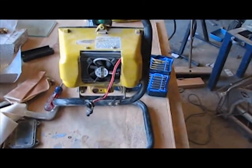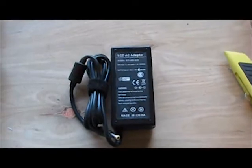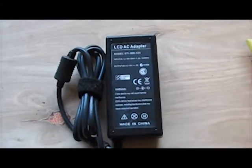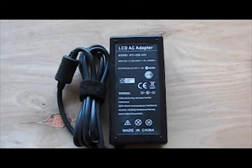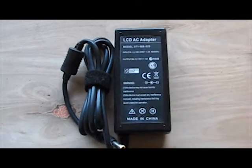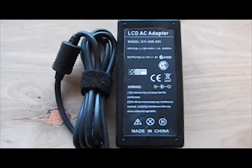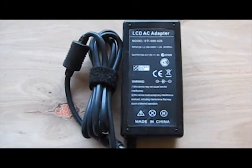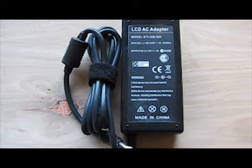Okay, I got that mounted in there. Before I plug this in, I'm going to tell you I was burning those LEDs for about eight hours using one of these power supplies made in China, rated for 12 volts and six amps. This thing should only be using about three and a quarter amps, but it burned out the power supply.